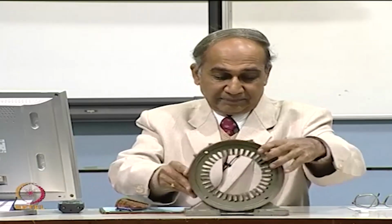Okay. So, now we have seen the practical construction of the single phase motor. Because this is only one type, there could be other variants of the same thing, like the ceiling fan. In a ceiling fan, it is a single phase motor, and it also has 2 windings and a capacitor, but it is a permanent capacitor. You do not have a centrifugal switch there, because a fan runs at different speeds. But the one difference is the rotating part is outside, so it is an inverted one. Your squirrel cage is outside. Or in a table fan, instead of this wound stator, you have a shaded pole. So, the second winding is just a closed ring, that is called the shaded pole one. So, different variants are there of these motors.